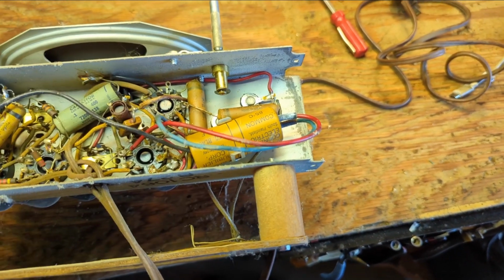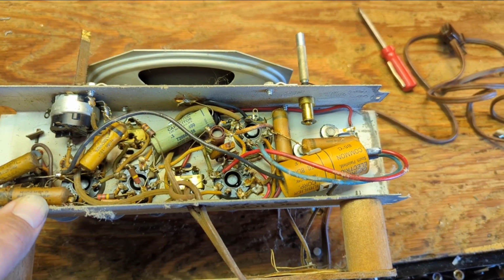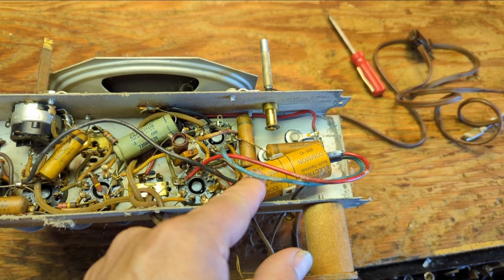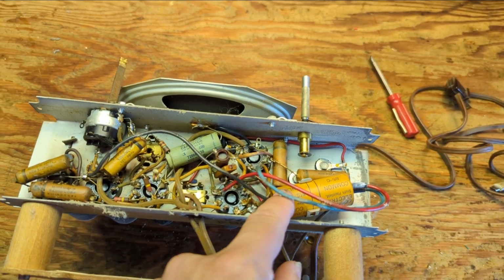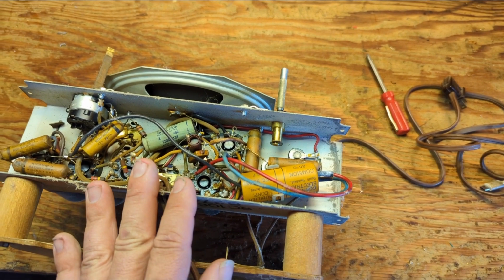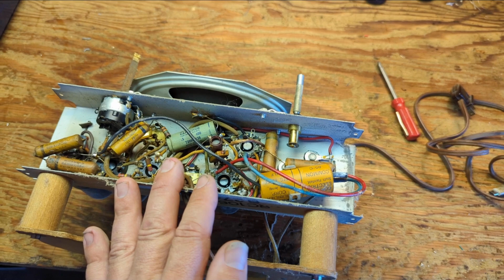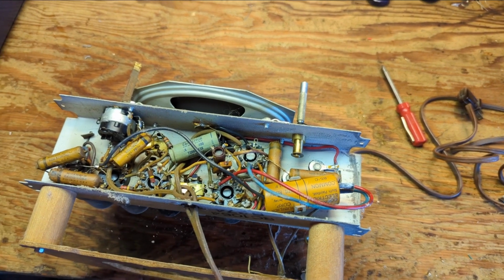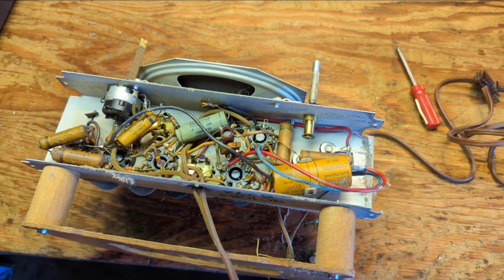So, I mean, that was definitely a major supplier to these brands. They're still around. But that's probably either a 50s or 60s era capacitor. If you think about it, I believe this set, like its Radiola cousin, is from 1946, 47. So it makes sense that by the time you start getting into the 50s and 60s, the original electrolytic, which was probably made to order on the absolute cheapest run, would have given up the ghost. I find that in probably about 75% of these AA5s.